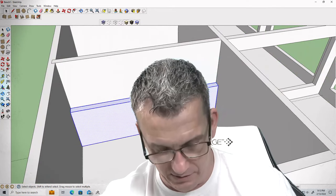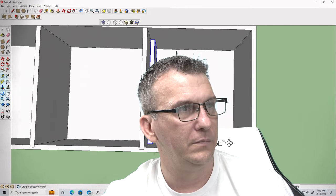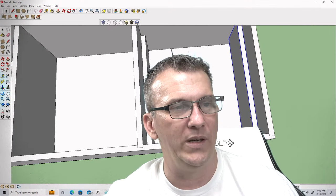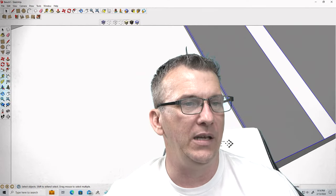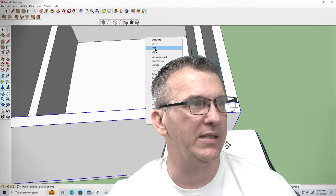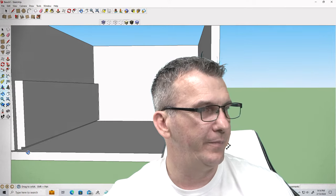Okay, and then I can G for group. Let's come here so you can see what's going on. Let's move this onto the screen. All right, M for move. I'm going to hold down the control key and I'm going to drag this over and snap it here. And when I do that, it's backwards, right? So I'm going to flip this part and I need to flip it around my green axis. And what that's going to do is bring that rabbet on the inside where the other part should be. And if I hide this front so we can see this better, by flipping it on the green axis, it turns that rabbet facing inward. Okay. And I can pull that down and snap that to there.